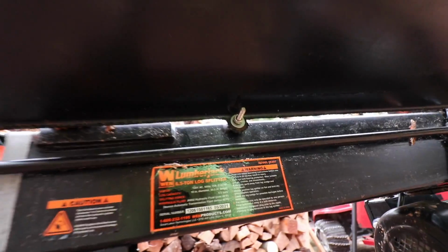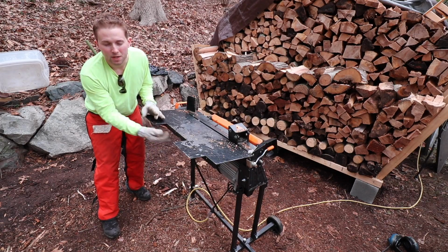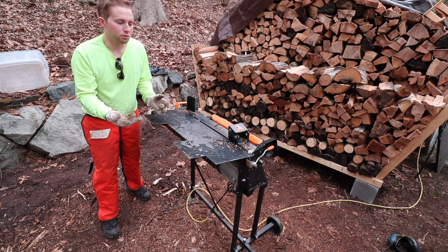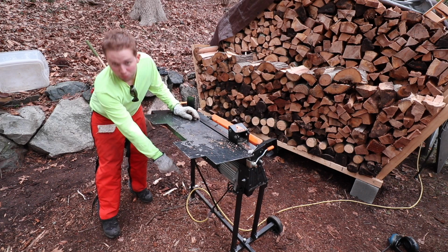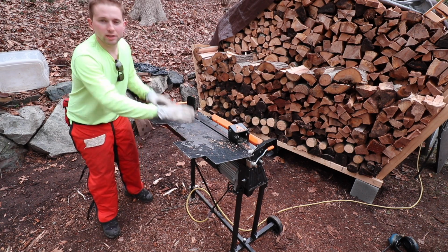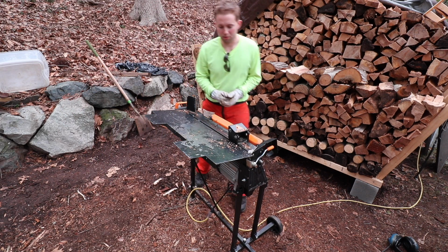But of course, we needed some type of brace, something to support the underside of this. So I had a piece, I don't know, this is maybe 1/2 inch rod. So I welded on a little nut to the bottom of the frame, and then I did the same thing to the top, but it's actually welded onto that bolt. So in theory, if you wanted to, you could just remove this bolt, and remove that little cotter pin that holds on that 1/2 inch rod through that nut down there, and you could remove this table in case we ever need to do that for maintenance or whatever.